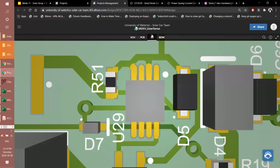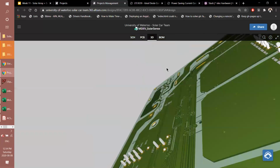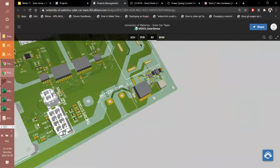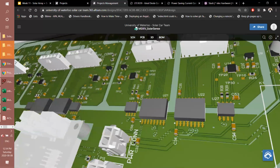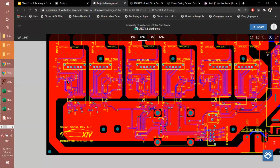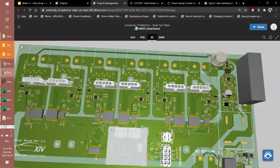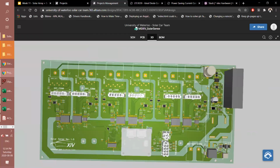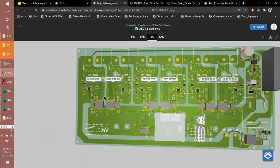And then, of course, there are 2 of these boards in parallel again. In the case of the 5 MPPT board, okay, we're going to go back to here. Of the 5 MPPT board, this will be shorted so that we don't have the 2nd MPPT or the 6th MPPT being an input. So that's the entire board. Does anyone have any questions about the board itself? Design-wise, or otherwise? Go ahead.